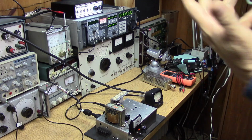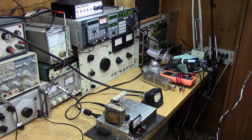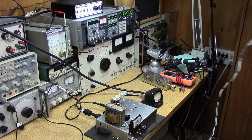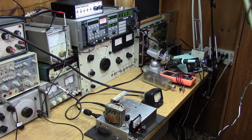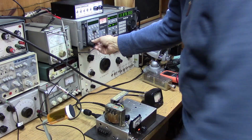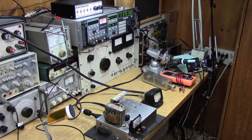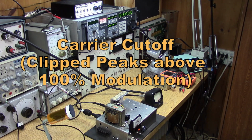That, again, comes right out of an ATX power supply. And then there is no negative peak clipping. You can't really put that on this. There's no iron or anything in here, but some type of pre-processing, I'm sure you guys have been doing that for 25 years. Okay, very good. I think you're almost there as far as modulation level. I just didn't know if you could get to the point where you're doing some carrier cutoff on peaks.